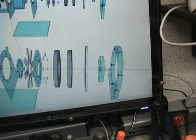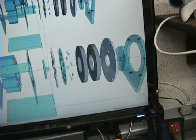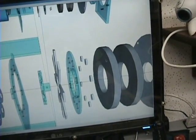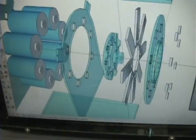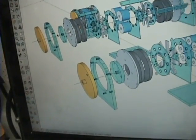The breakdown shows: an end plate that holds everything, a plastic housing with a bearing, then a metal plate — two ring magnets stuck together that came out of speakers. These are little steel cores that go on the surface of the magnet plate, which concentrates the flux into one area. I'm not sure if that's good or bad and haven't tried it yet — that was part of my initial design. Next you have the mu metal shielding plates, then a rotor that those sit on, then a plate that holds the coils in place. These coils have cores — if you watched my other video you saw me making one of them.